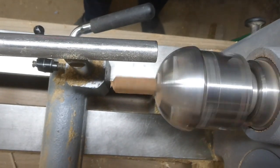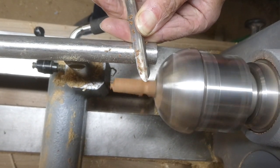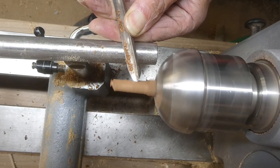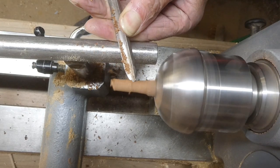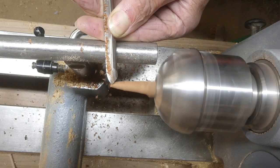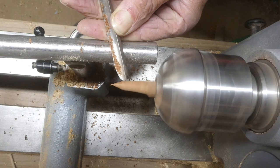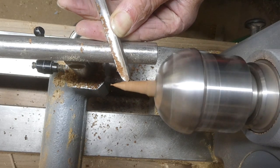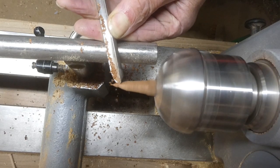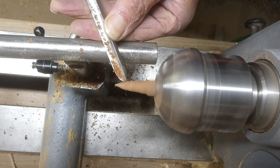Right, here I've got a little piece of wood — not quite sure what it is, could be a pyinma or something like that — but it's a slightly darker wood than the oak. I'm just turning it down to round; it's about 10mm by 10mm and it's a fairly long piece but it goes into the chuck. I'm just creating a point on there using the 3/8 spindle gouge again. This is going to be the beak.